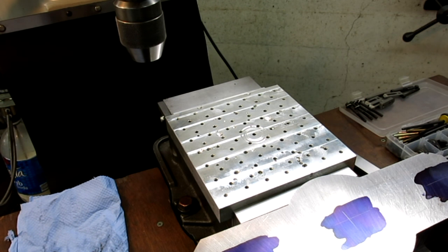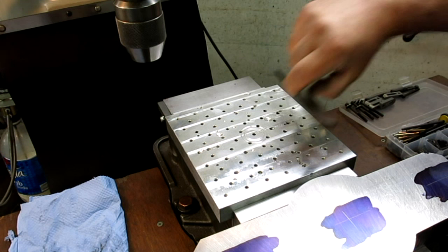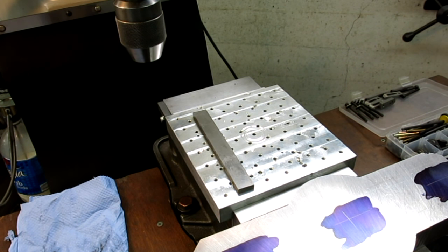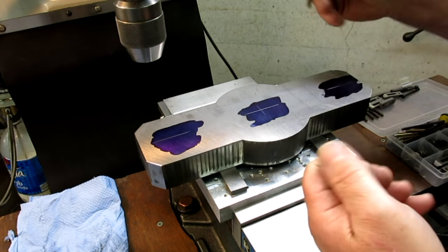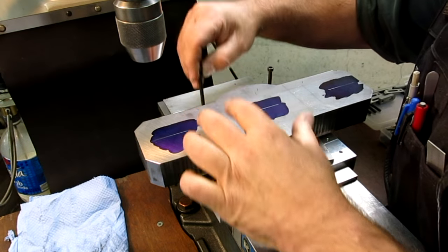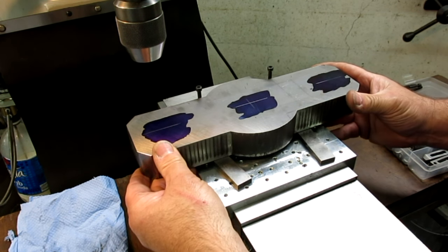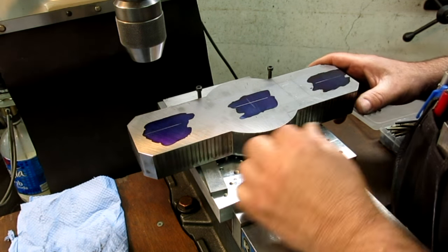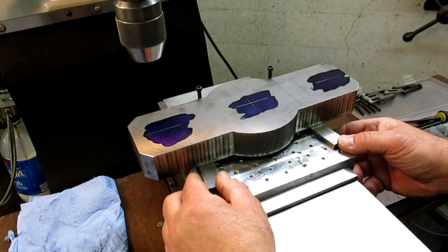So first off, I think what we're gonna do, oops. Yeah, it helps if you grab two parallels in there, Mr. Wizard. Actually, I think I've got one there. That'd screw you up. So let's get it off of the surface to start with, okay? And then I'm just gonna use a couple of screws that are stuck in a couple of the mini pallet holes here. What these are for is just to give me some basic alignment, or basic parallelism with the edge of the mini pallet, okay? All right, let's do that.